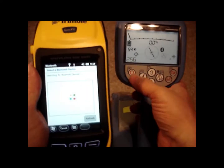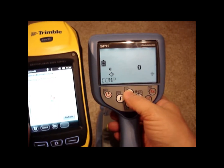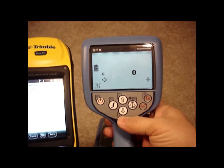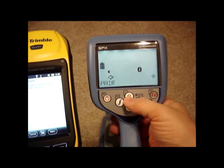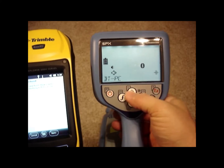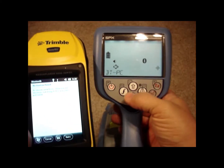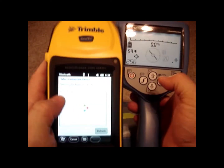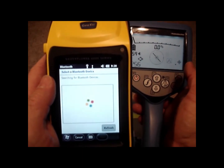I hit Add New Device and now it's searching for that device. I have to go into the locator menu system by hitting the on/off key quickly, and scroll until I see BT for Bluetooth. I'm going to go into the Bluetooth menu by hitting the peak and null button, then go to pair mode by hitting the up arrow. Once I see pair mode, I'll enter it and select to pair it to a PC — which is what the GPS unit is. I'll hit the left button so my Bluetooth icon starts blinking, then hit Retry to search for Bluetooth devices again. Eventually I'll see the RD8000 show up on the screen.